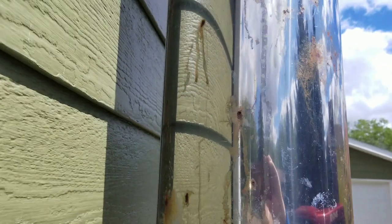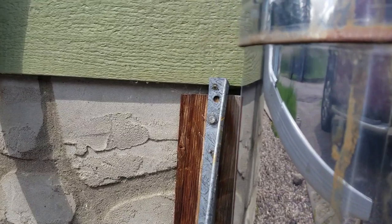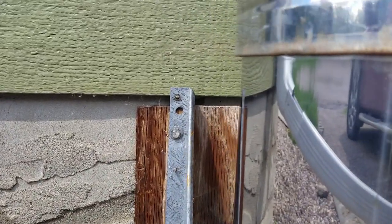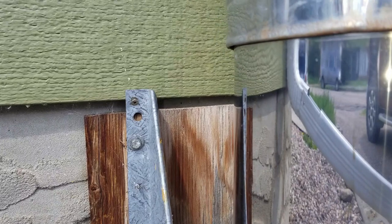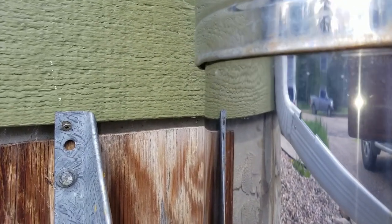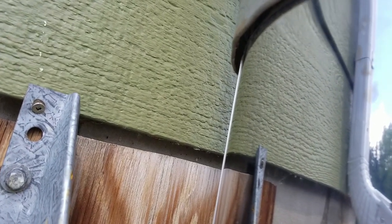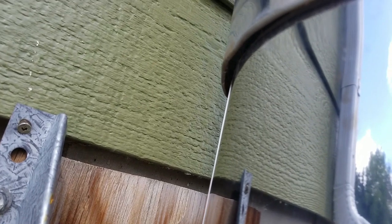If the chimney has rusted through, it's no longer certified. In this case, when you look closely, someone has used two types of chimneys — the base T comes through as one type, and as you look up you can see the chimney above it is a different diameter and not a perfect fit. Therefore it doesn't pass — you are not allowed to mix and match chimney manufacturers. Make sure nothing combustible is within two inches of the chimney inside the soffit.